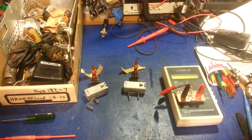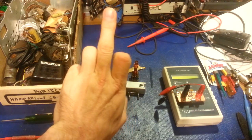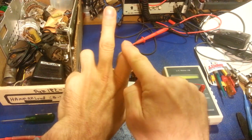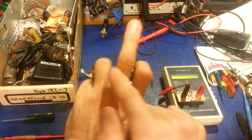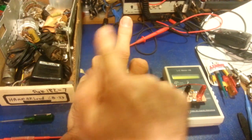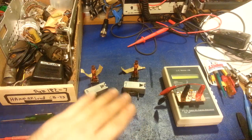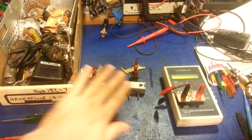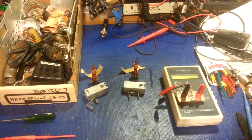What I wanted to try and do was — remember we had three peaks: a really big peak at the 25 megahertz, then a little small one on the CB channel, and the other one at minus 1.75 megahertz. So with the spectrum analyzer, go through and adjust all of the oscillator alignment points for the transmit circuit, oscillators, and mixers. And surprisingly enough, I can pretty much squelch out or filter out almost everything and bring up the 27 megahertz.